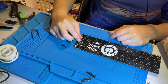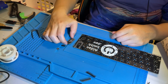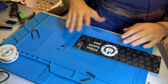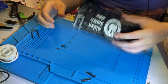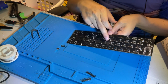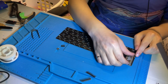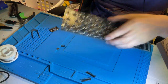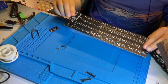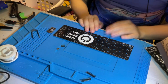Something else to note: you want to make sure you're putting the microcontroller and all other components on the right side of the board. It's pretty hard to put it on the wrong side with the Hotswap version because there are so many Hotswap sockets — you clearly don't want to put it on that side. With the solder board, it's a little less easy to notice, so just make sure you're putting it on the right side.